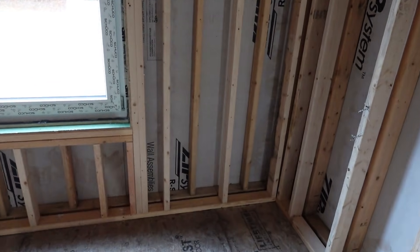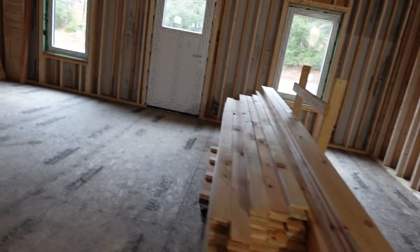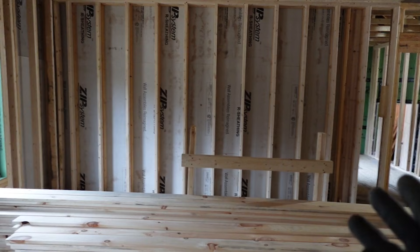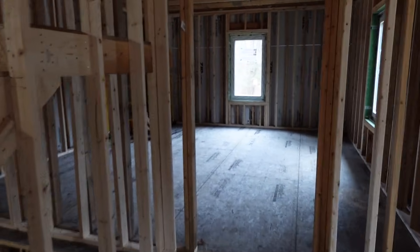On the exterior you can see the exterior stud and interior stud. That's a full eight-inch wall because it's three-and-a-half plus three-and-a-half with a one-inch gap. These are offset, which doesn't really matter but I prefer offset studs for a little better thermal bridging. The kitchen wall here you can see is lined up — double stud but lined up — because the range hood has to go in and I didn't want to try to sneak a six-inch pipe through offset studs.